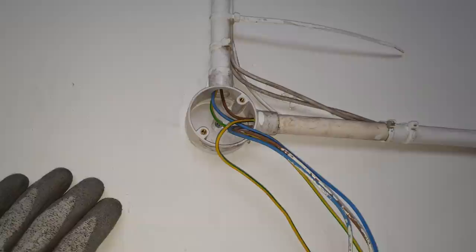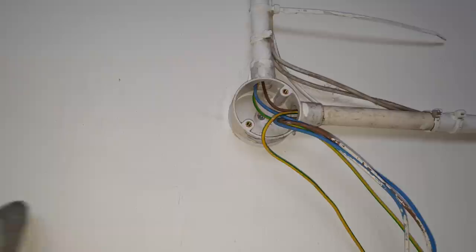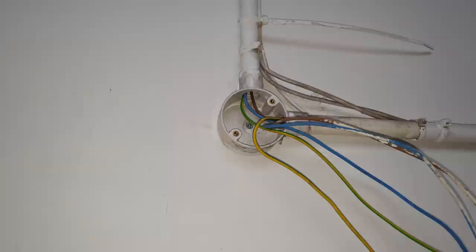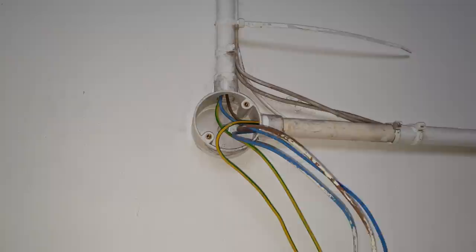And it's just like if you're wiring along, putting up some fittings, say on the outside of a building along the wall, I don't think it's good to come up with the conduit to the fitting, put your fitting in and go through, like wiring through the fitting. I don't think that's right. I think you should come with a box, wire through the boxes, and you fit the fittings on top or below to the wall, not to the box.